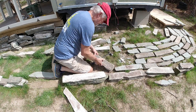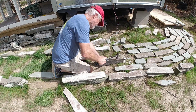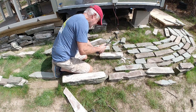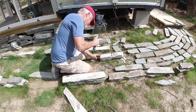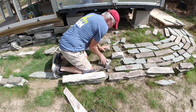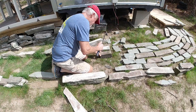My goal here in the beginning is not so much to lay out the stones where they're going to go, because I'm going to pick them all up anyway. I just want to get a bunch of them split so they're all semi the same thickness — learn how to split them and make sure I have enough. I'm just prepping a bunch of these so that when I put the concrete on the ground, all I have to do is lay them out and wiggle them to grade, which will be much quicker.